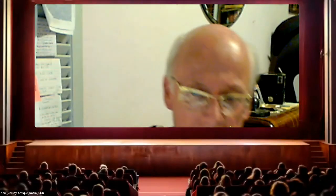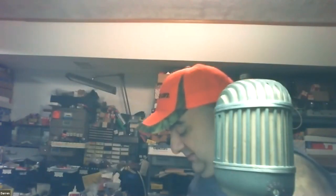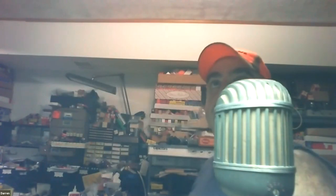Is this like John Henry, the 5 volt, 0.09 amp, or 0.45 watt? Say it again. It's a 5 volt, 0.45 watt, or 0.09 amp. Wasn't a 47 a 6.3 volt? Yeah. What's the number? 1850. Yeah, Joe just had it, Darren. Okay. Yep. 1850 is 5 volts, 0.09 amps, yeah. And it's good for 1500 hours.